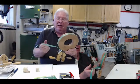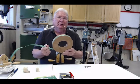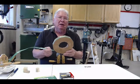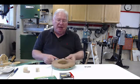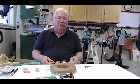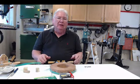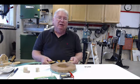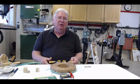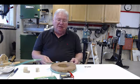The nice thing about the nylon strapping tape is that glue doesn't stick to it, so when you're through you don't have to worry about it getting caught up on squeeze-out that you may have. It's a relatively inexpensive way to make a very flexible clamp that gives you a wide latitude of sizes that you can use in your segmenting.